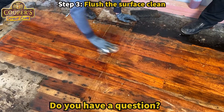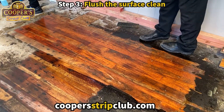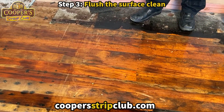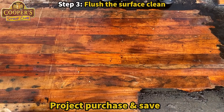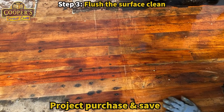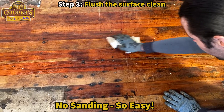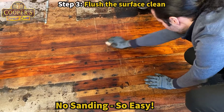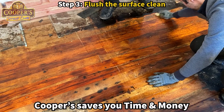We're just quickly wiping away the residues. The wet look is what we call the finish look. Because we have a system around no sanding, and the reason there's no sanding is because it's already sanded. When it's wet with flusher at this point, this is telling you what you're going to get when you put a finish on. When this dries, it will quite possibly take on a sort of manky look, and you get tempted to get sandpaper out — and that's exactly what you do not want to do. If you're happy with it wet, that's what it's going to look like with a finish on.